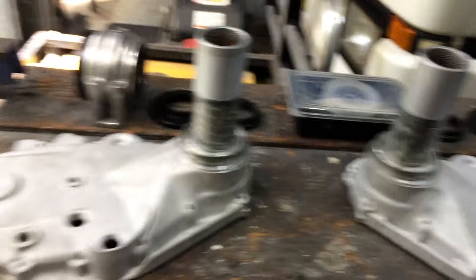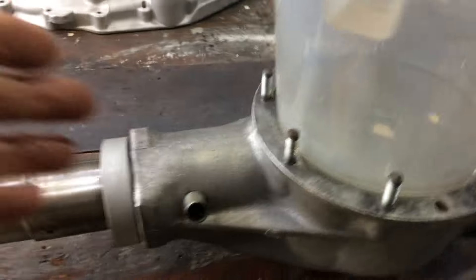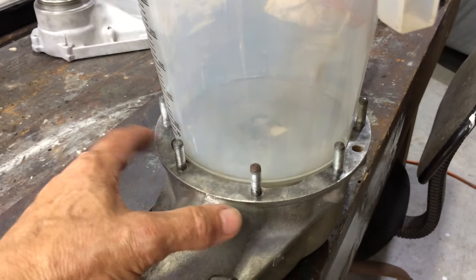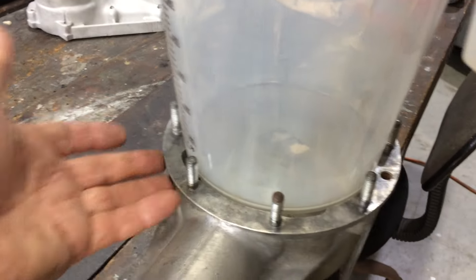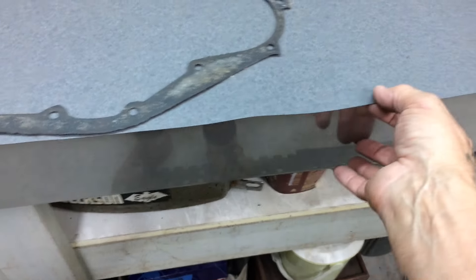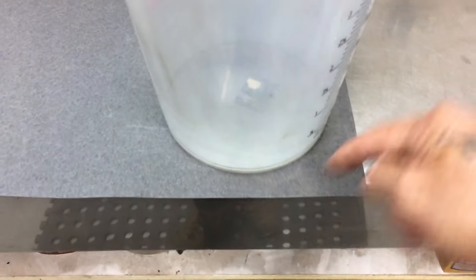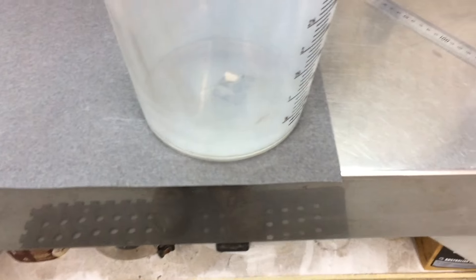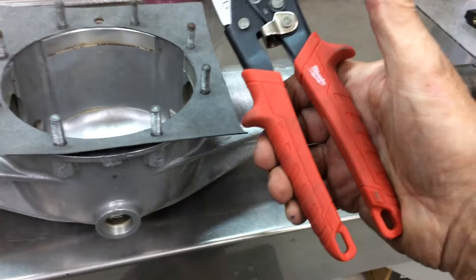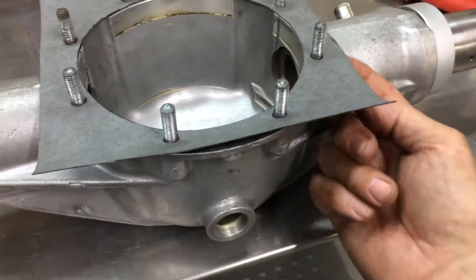I just have to make this gasket now. I found something round that just fits in there perfectly, so that's going to be my inner diameter. I'll cut it at that size, add whatever that measurement is, cut that out, then stamp out the holes. This gasket material is 0.8 of a mil - it's 1000 mil long and 500 wide, so I've got plenty of room. I'll trace around it, measure out 17 mil right around, trim it off, and punch in the holes.